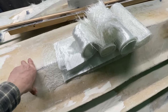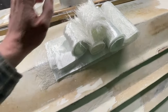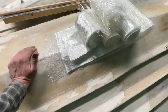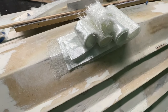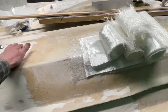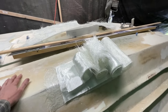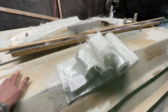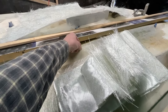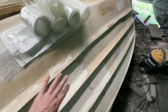That should give us something about 7 to 8 mil, I guess, because this is very thick material. This is also actually thick, so maybe 8 mil in the bottom, and that's good because this is a keel. And well, when this is done, I will look at the edges here and use the fiberglass putty to put on to shape up the corner a bit more. After that, I will tilt the boat back on the other side and continue over here.